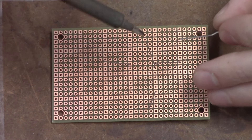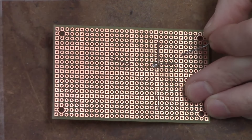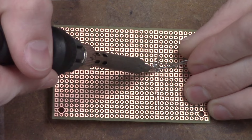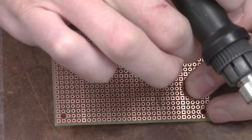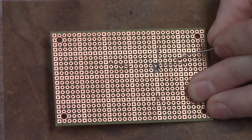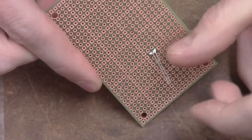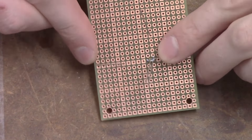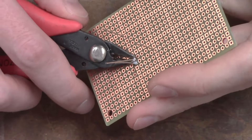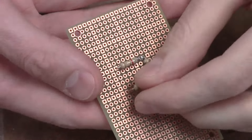When soldering, it's helpful to place the padboard on a flat surface with the leads facing up. Apply solder to both neighboring pads one at a time. A screwdriver tip is better than a conical tip for making solid contact with both the pad and the component lead. To connect the joints, touch the soldering iron between the pads, making contact with both solder joints, and apply more solder to both pads. After the joints are soldered properly, we are going to trim the leads, but first we will inspect the joint to make sure we have a proper connection. Once we are sure the connection has been soldered properly, we can trim the leads. We are going to repeat the process with another resistor.